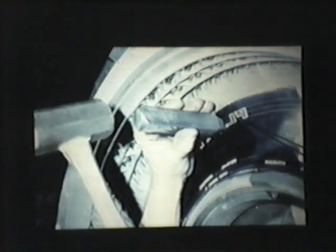Tightening them there. The engraving on the sidewall. The sidewall plate might be removable or it might actually be part of the mold ring itself, depending on whether it's a generic design or a flagship tire of the company, like the Goodyear Eagle GT Plus 4, for example. The sidewall and the mold ring would all be one unit. This can be done by punching or laser controlled engraving machines or what have you.